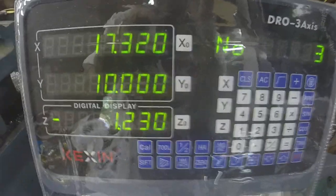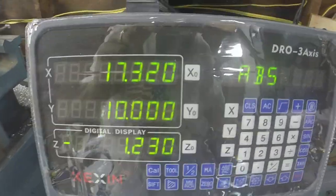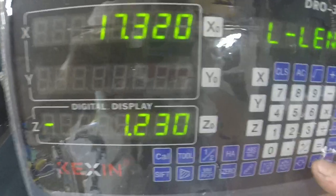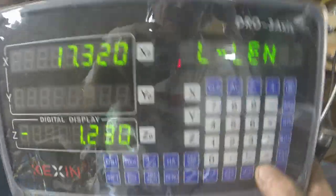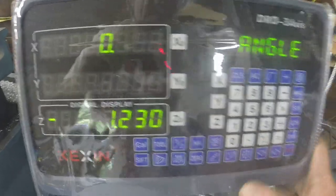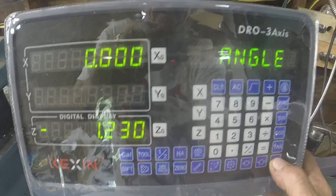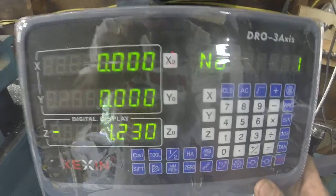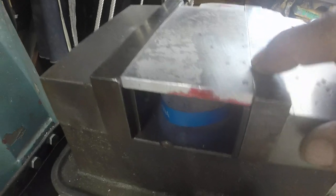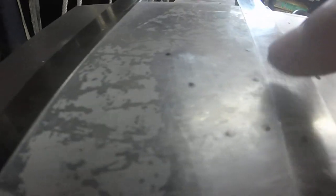Let's make a straight line. We just exit out of there — assume I moved it back to zero. It's always X, Y. Now we're going to do a straight line, length of 60. This time, instead of a 30 degree angle, we'll go zero angle, still four holes. There's my number one hole at zero. Go down to hole number two — I'm moving my X 20. So there's my second hole, 20 away. Then each subsequent hole is 20 away, until I get to a length of 60 with four holes.